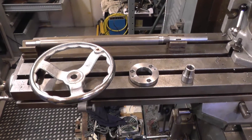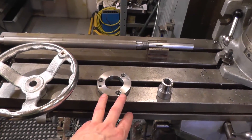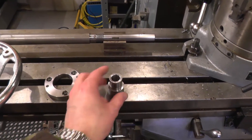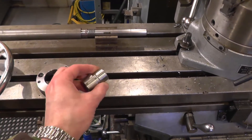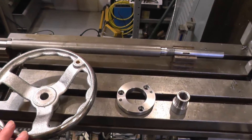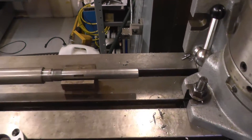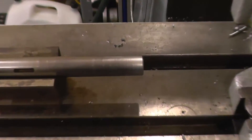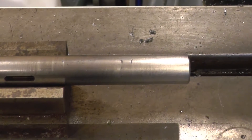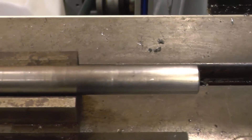Here's the progress so far: got the adapter for the power feed body, the nut which holds the bearing in a race. I've bored out the hand wheel and extended the knee feed shaft. Zooming in, that's just about the worst spot of the join, but overall very pleased with that — perfectly functional.